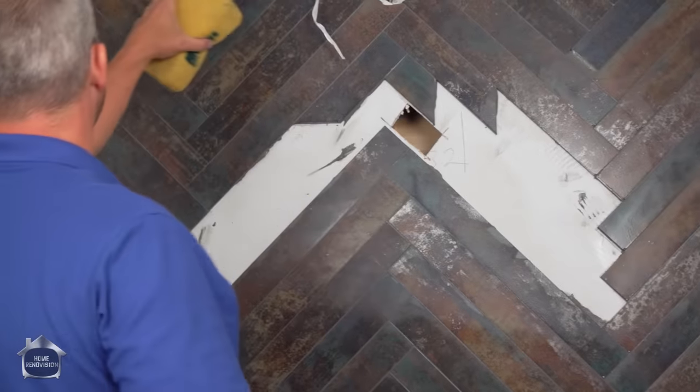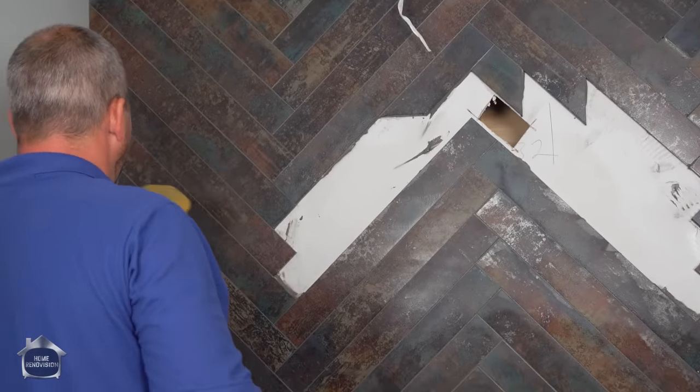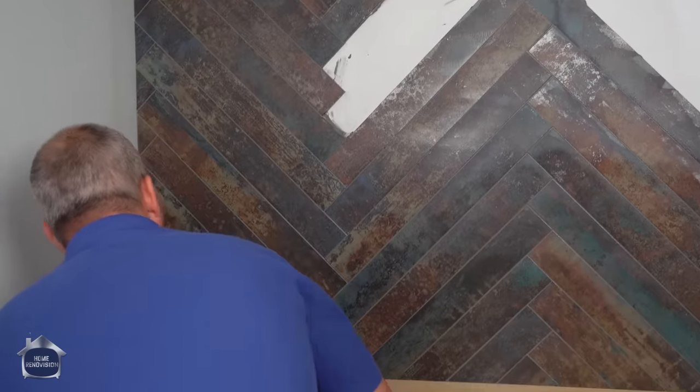Right now that we're washed, there's still a couple things we have to do. We need quality control. So you take a little blob of your grout left over from your pail, and you really want to just go through this really small area at a time, focusing real hard, and don't just look down, actually get down. Get right in, and see, here we go. Okay, so we just take this little bit and smudge it in. There's one there, and leave it messy.